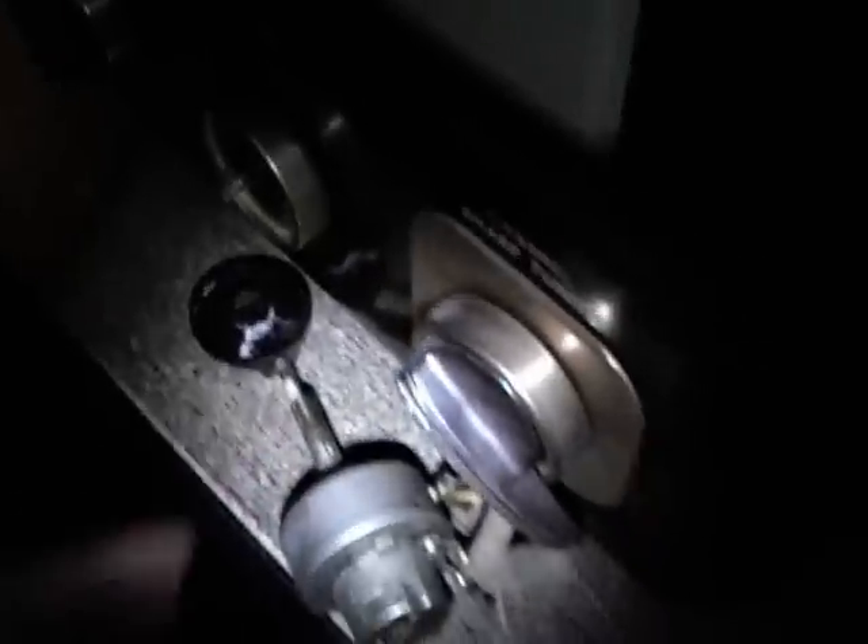The other piece I've really been looking hard for is over by the sink. I actually have another Admiral 20x122 that I got about a year and a half ago — it was in rough shape but all complete except for a few knobs and this metal piece. This metal piece is the shield that goes over the RF and IF amplification stages. On the other chassis I've got, it's just wide open, making it very susceptible to picking up noise and interference. I'd never seen another complete 20x122 chassis, so I didn't even know what this was supposed to look like — I'm really glad I found it.